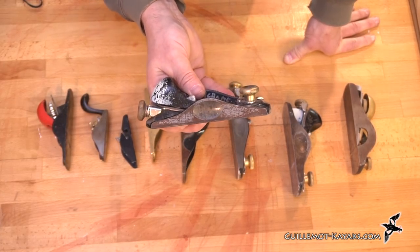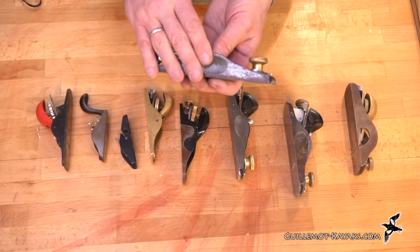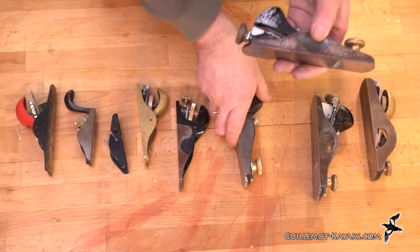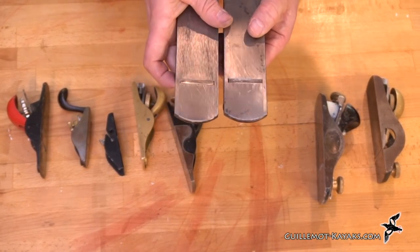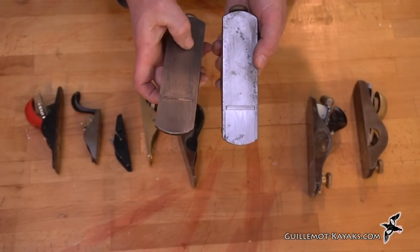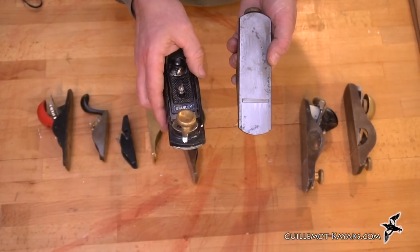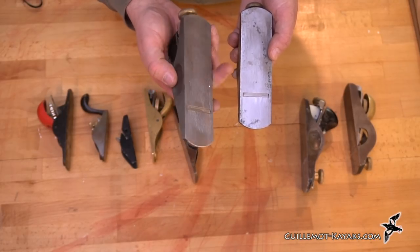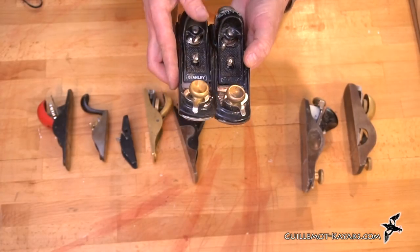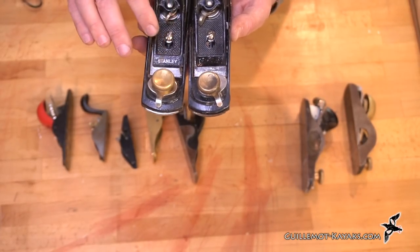This Stanley I've had for probably 30 years now — still the same blade on it, works great. Even in my lifetime, the quality of Stanley's tools has deteriorated; they're no longer quite as good as when I bought this in my 20s. This more contemporary Stanley — one thing you can see right off the bat is the bottom is very rough. It ended up in my tool bag after a class, so if this is yours and you were in one of my classes, I have it. The quality of the castings is not as good; this is a much finer pattern on the old one — they're just not reproducing the smooth castings they used to.